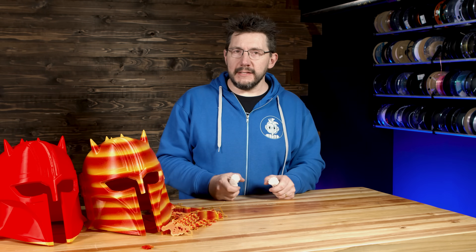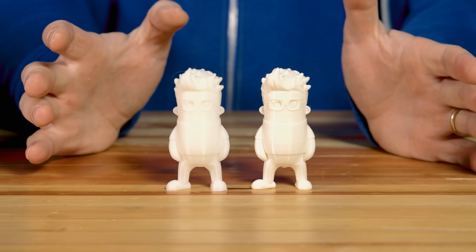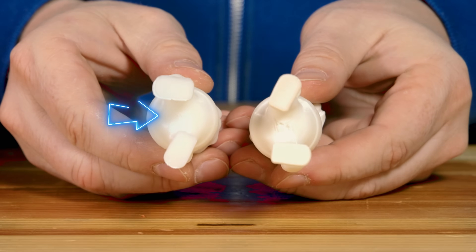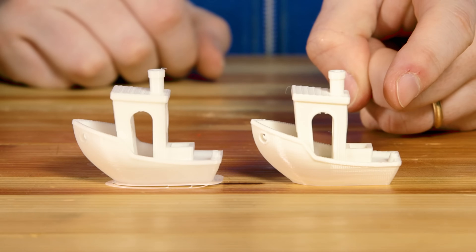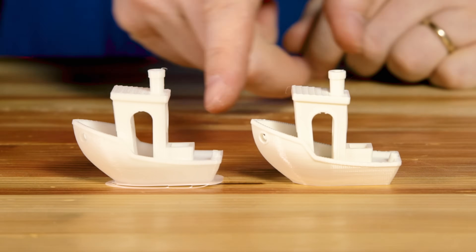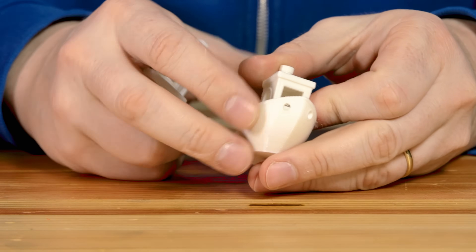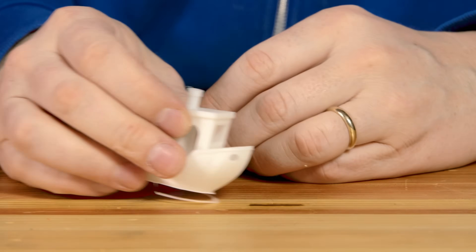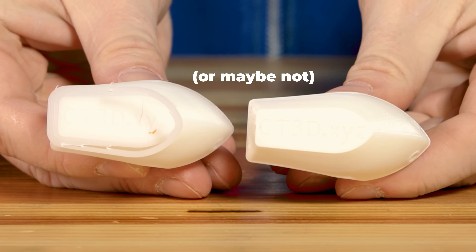Let me give you a chance to have a look at the models yourself. Here are two Mini Joels — the Joel crotch is actually better on the high speed. Now 3D Benchy: this one is the slow speed one, this one is the high speed one. I see some stringing on the slow speed — the high speed appears to be of higher quality. If you look at the port window right there in the bow of the boat, there's a slight droop of filament on the slow one, and there's not the same droop on the high speed one. You can read the words on the bottom of both.